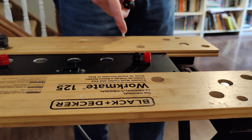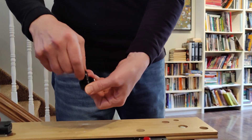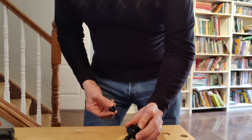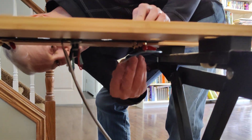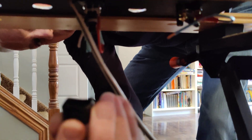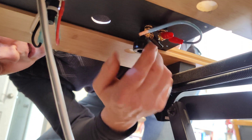To use this you drill a hole which is basically the same as the outside diameter of the threads. You take this little thing — it's just a simple great big chunky thread here. It's an M10 with a 1 millimeter thread. You take this piece which has the lovely little chewy bits on, and we're going to use the knockout punch to shear off this metal.